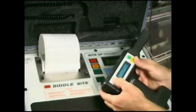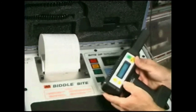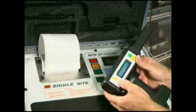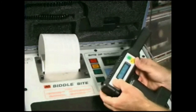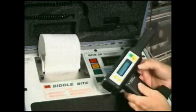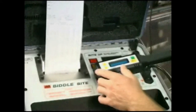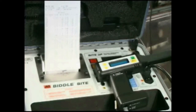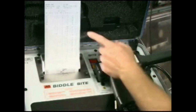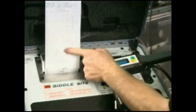It shows you the amount of cells available. Now I'm going to print out through the printer — I'm going to select test number two again and hit accept. You'll see a difference in the printouts: it's now printing out a bar graph that will compare each cell with the string average of those cells. Therefore you can see how each cell is doing compared to the full string. We also added a baseline value to this particular test, which is one of the columns showing pass, warning, and fail — and it will show how each cell fared against the baseline value entered, which is shown up here in the header information.